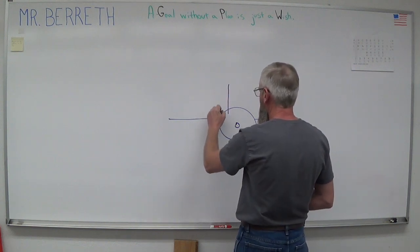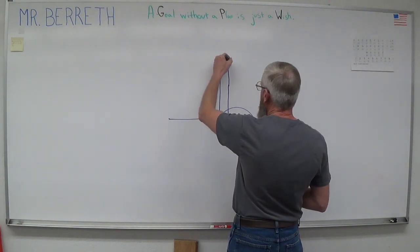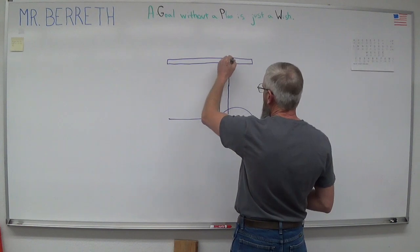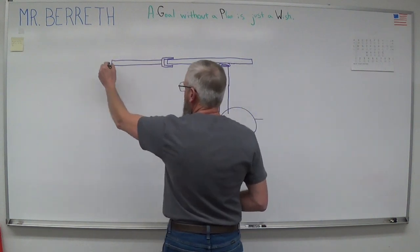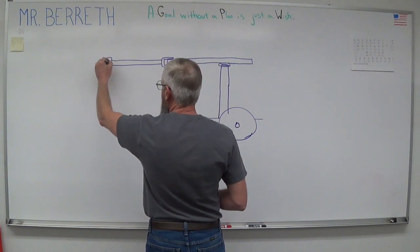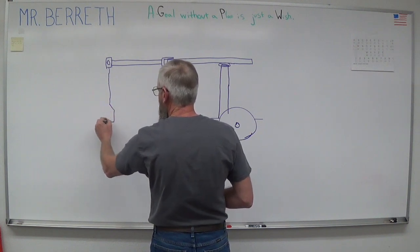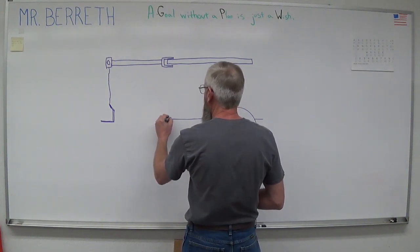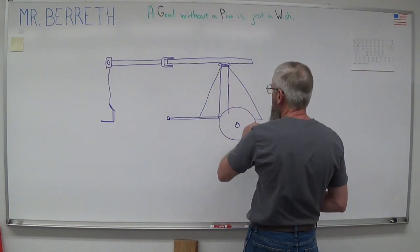The loader would be mounted here with a swivel of some sort attached here, an arm that would extend out, and then an additional arm attached out here. I'd hook an ATV winch on the end, and the cable would come down with a typical fork mechanism. This would be where our trailer ball hooks in, and we'd probably need some guide for this main support to keep it stationary.